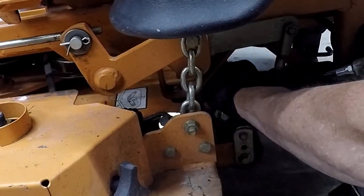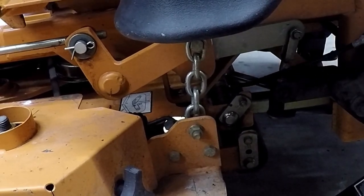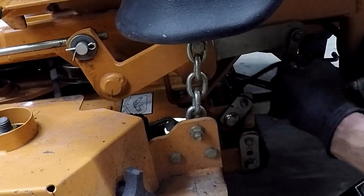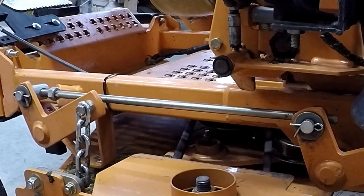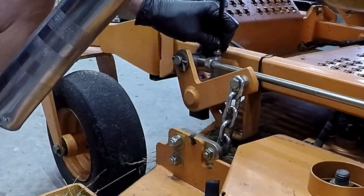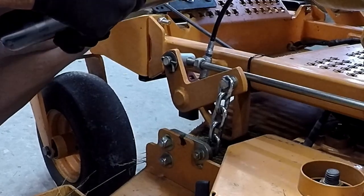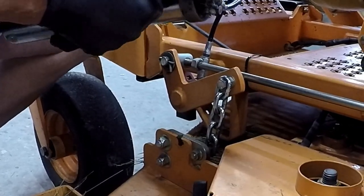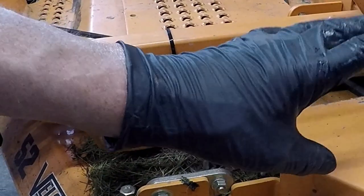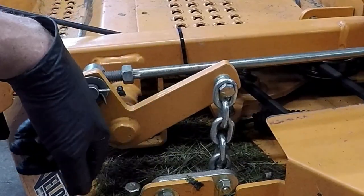This is the deck. You don't take very many pumps - I don't know if you heard a pop already, but you don't take much. One pump. That took a bunch - that took ten. Now, they recommend greasing the spindles, but there's a problem with greasing the spindles: them are all sealed bearings. Where's the grease going to go?